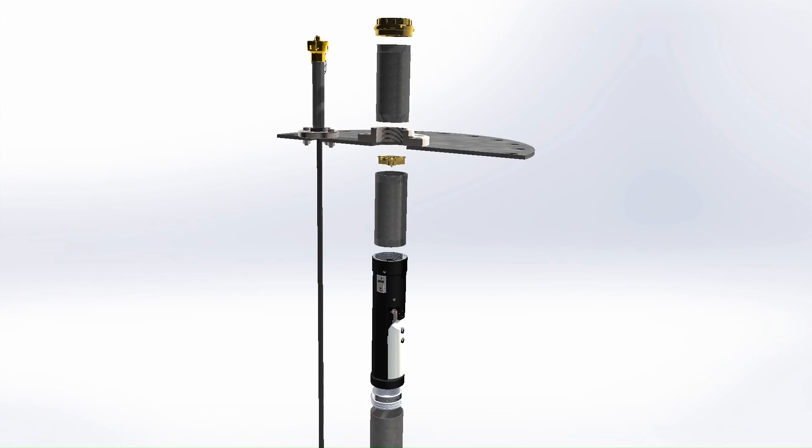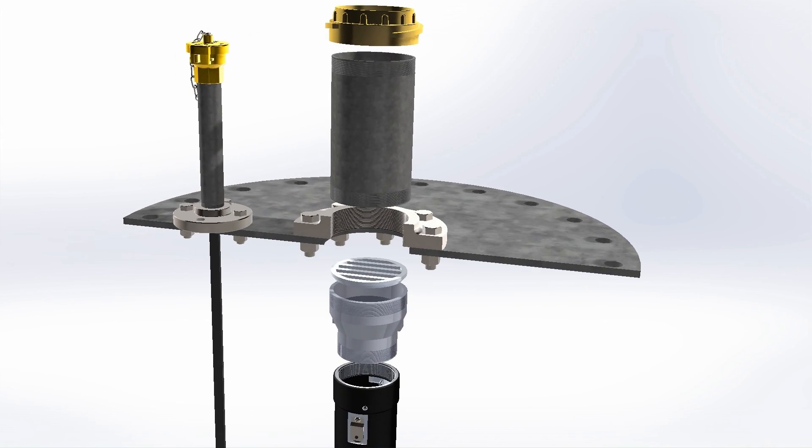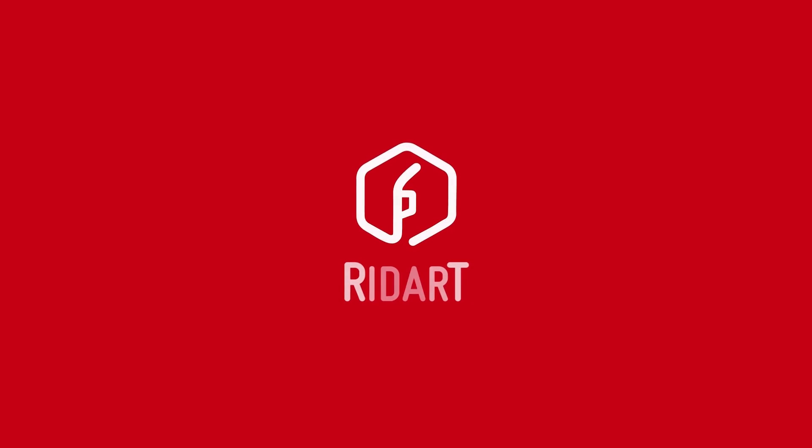Alternatively, we provide an equivalent four-inch configuration with all components scaled, available only for the 442B overfill prevention valve. Alternative configurations may also include a four-inch loading duct with a reduction to a three-inch overfill prevention valve. This configuration may be useful if a three-inch flange is not present on the manhole, or if the four-inch flange hole is not wide enough to install the four-inch overfill prevention valve.